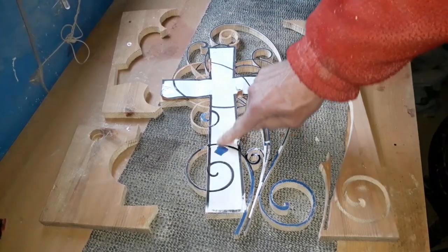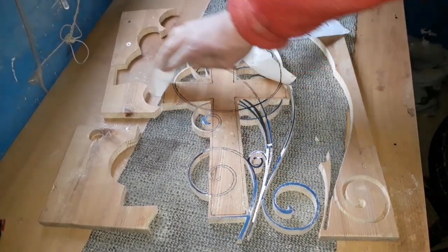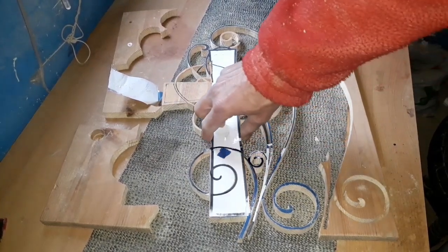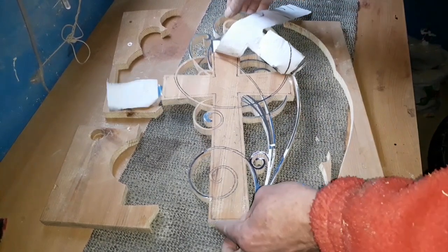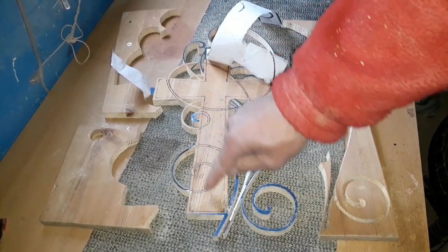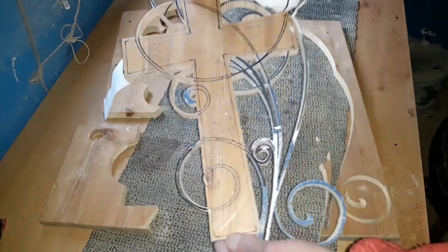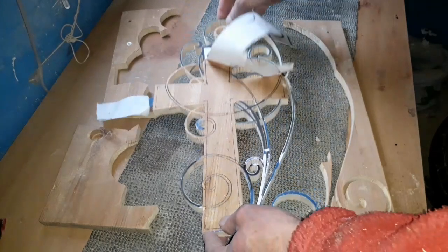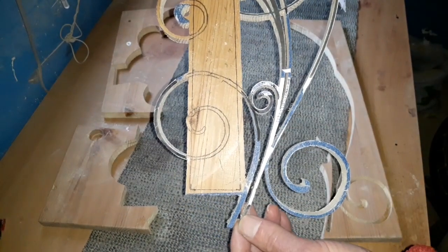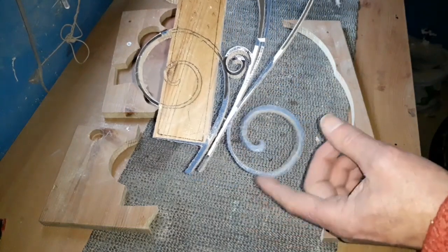I've saved these cut-out pieces because when we come to route the middle section, I've removed the template, placed carbon paper underneath, and literally just drawn around it - leaving the design on the wood. That section we're going to route out, routing all around these curls so the curls will be slightly higher and we'll fill it all in with resin. We don't need to go too deep - the deeper you go the more resin you'll use. On a quick note, this circle here I added myself because that area was too flimsy. I've raised it up to bring it together, though I'm not too comfortable with that one.